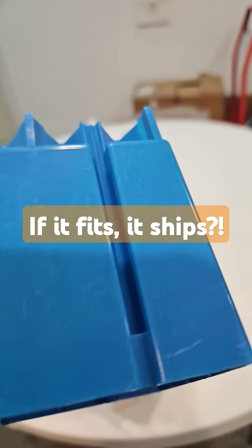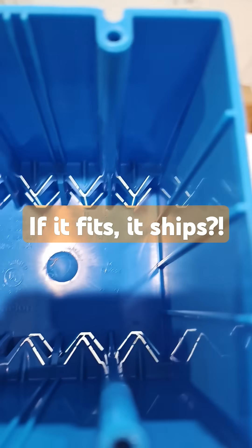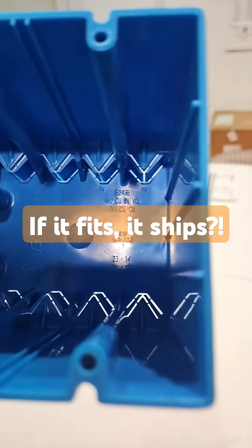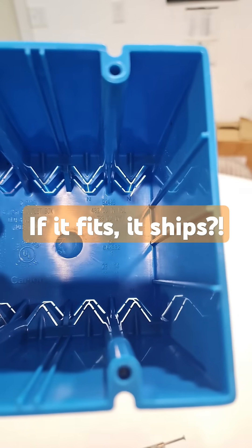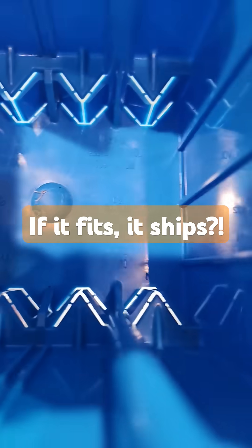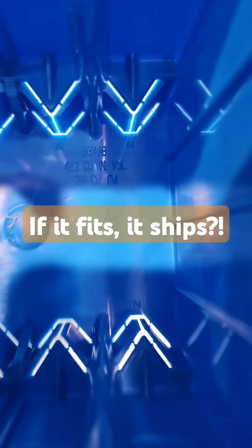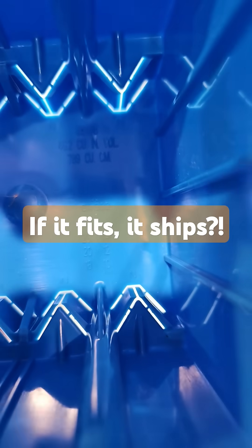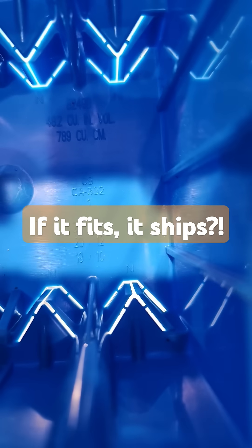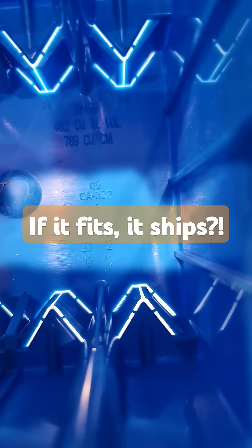We were using this box, and one of my inspectors said, look at those tabs in the back. See these tabs right here? He asked, is that rated for a 6-3? And I said, well, I can force it in, so probably yes. He goes, what about the listing in the back? And if you look real close at these numbers punched in the back, it's only rated for up to 18 number 10s. There is no mention of anything over number 10.